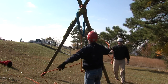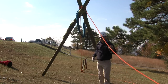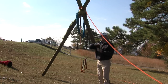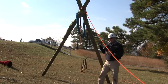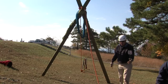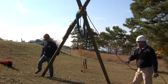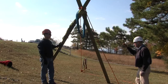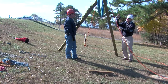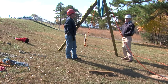From this point, if we've got a suitable anchor in front, we're going to run our fore guy to it. This is really important if you've got the system in a dynamic configuration where you're able to raise and lower it. All this does is keep it from going past center and over backwards. If you don't have anything significantly in front of you, as long as you can get out five to six feet and put in some sort of a picket or find the base of a tree, you can tie it off when it's raised to its highest point — just prior to being vertical, about 80 degrees. That's as far as you ever want it to lean back, because without the fore guy, there's nothing to keep it from toppling over backwards.